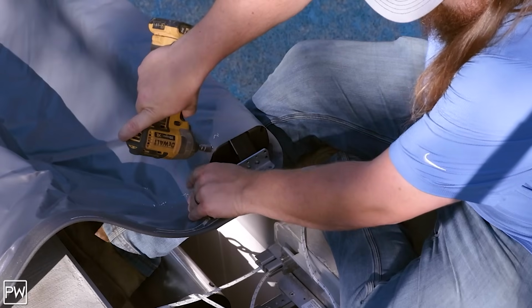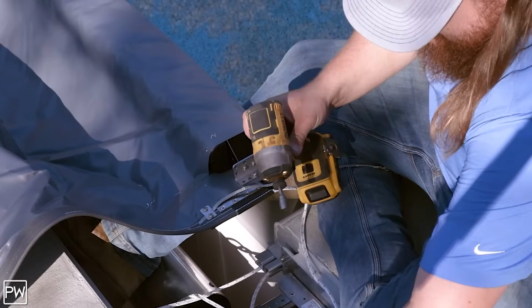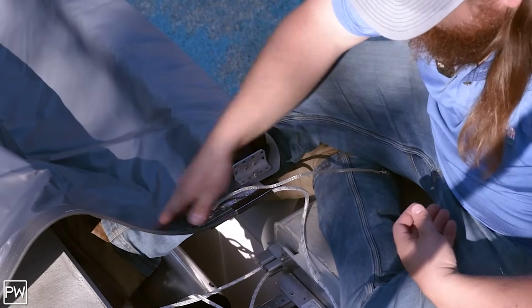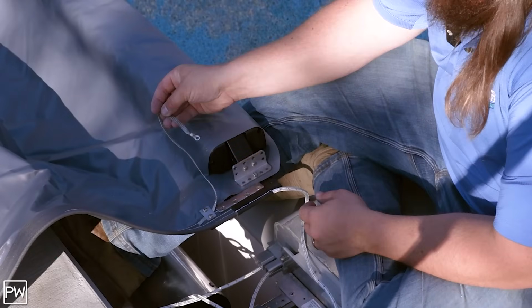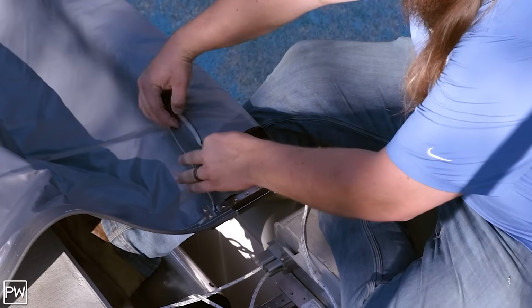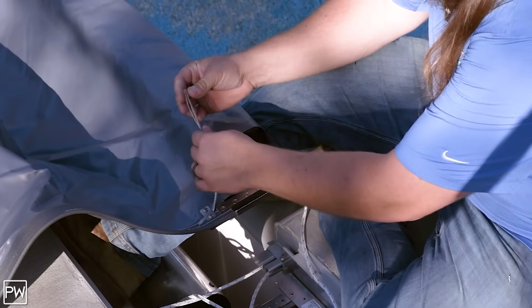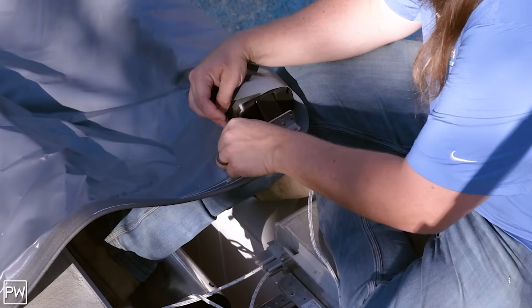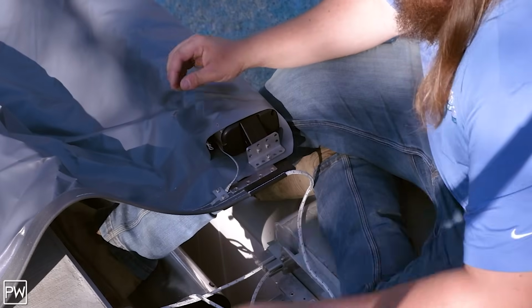Good. Take our screw back out, set it aside. Clean our metal shavings up. We're gonna take our bond wire eyelet, hold it right where that hole's gonna go, pull any excess bond wire out here, crimp it nice and tight so we can stuff it easily inside the leading edge bar. Just like this. Okay, we're gonna keep that eyelet where I can see it.